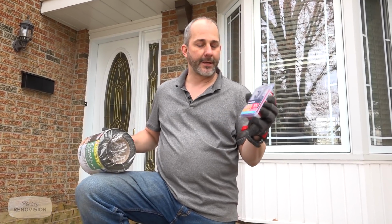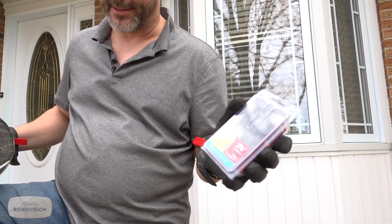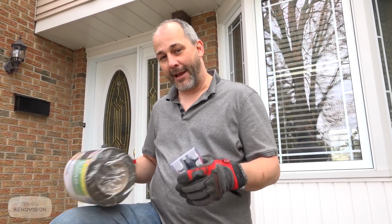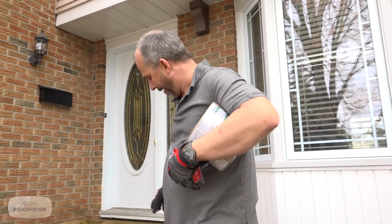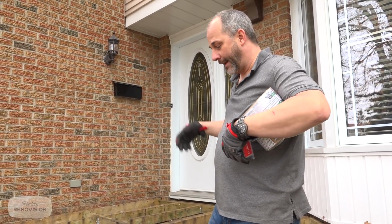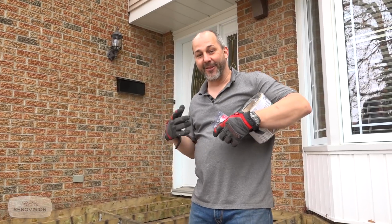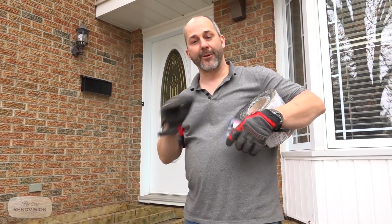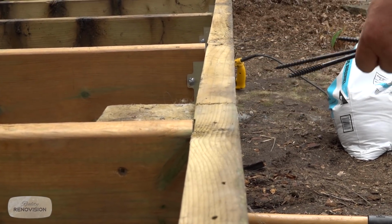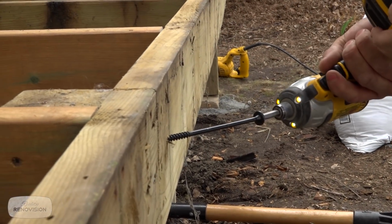The other thing we're going to use here is headlock screws. I love this technology. These things are awesome because they replace the strength of a 3/8 galvanized lag bolt, and they allow me to put structural strength in every piece of lumber that I'm tying together, not relying on nails or screws, so that I've got enough shear strength where I'm being creative with my repairs, that I can carry all the weight of a whole family being out here without any risk to their safety. This is a little overkill, right? Reality is 3 of these screws will hold the whole deck up.